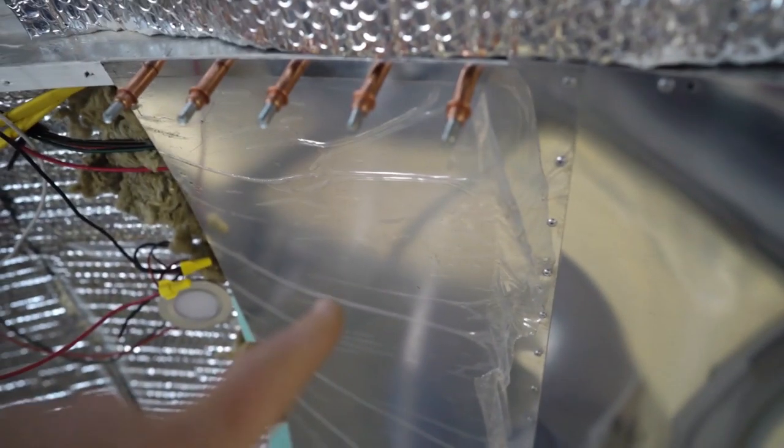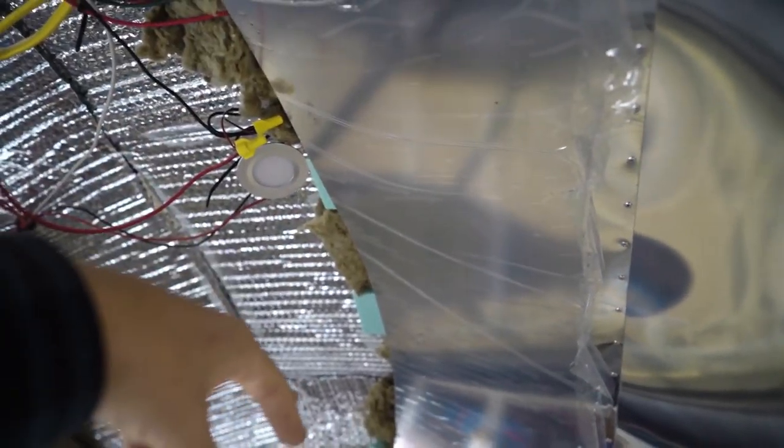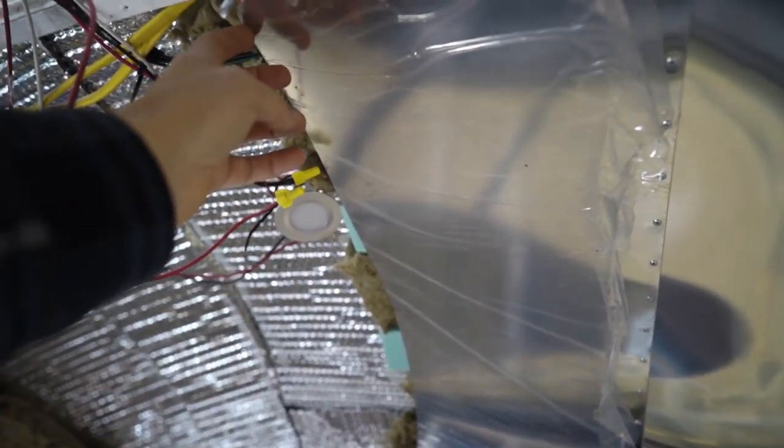So I'm basically putting them in place with the plastic on them so I don't fingerprint them all up. Overlaying the next piece, drilling all the holes, using the Clecos to hold it into place. Then once I get all the holes drilled and get everything lined up to where I like it, I take it back down, peel this plastic back along where the holes are going to be on the underlying piece, and then put the piece into place. And just like I did this one, pull the plastic back and rivet it in, but leaving the plastic on still so I don't mar them up.